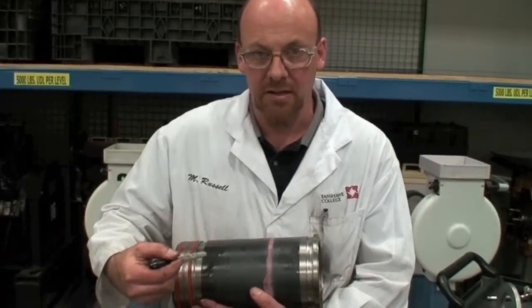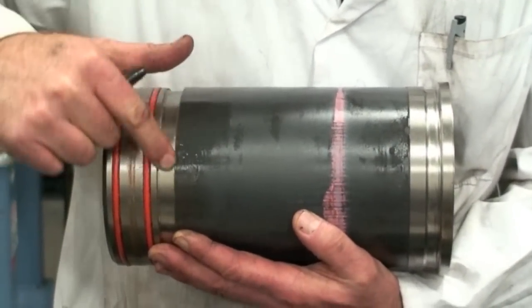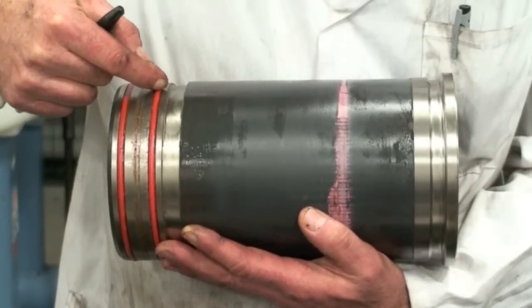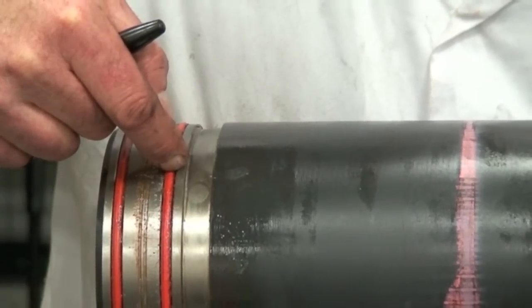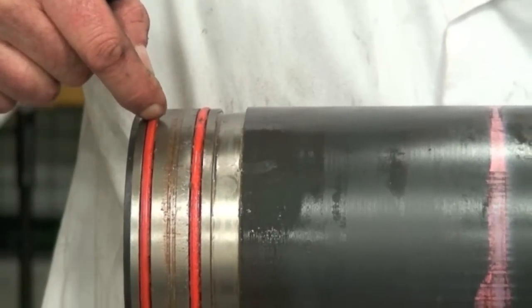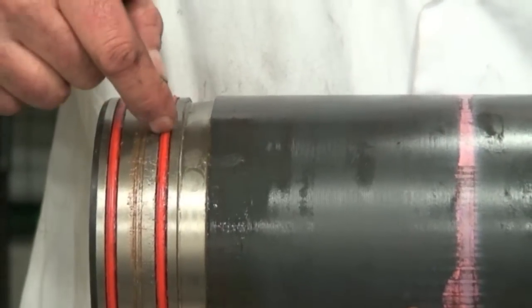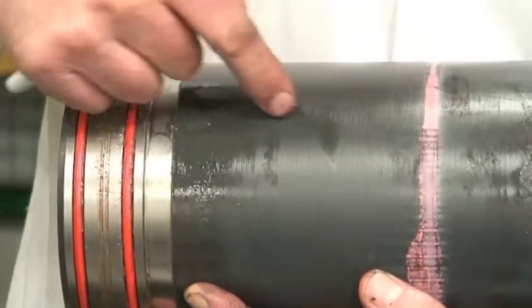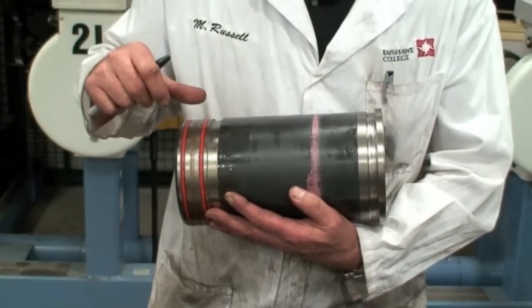If we take a look at the nomenclature related directly to the wet sleeve liner itself, you can see that we have a couple of different seals on here. One of these seals is going to be replaced. This is one of the main cooling system crevice seals, and then we have an adjacent seal that works in combination capacity with the cooling system seal — so if the cooling system seal leaks, the combination capacity seal helps back up the coolant crevice seal. On the bottom end we have an engine oil seal which also works in combination capacity with a secondary seal, so that if the oil seal leaks, the secondary seal helps prevent oil from getting from the bottom end up into the cooling system. When that happens we get the mixing of coolant and oil, and either or are destructive to the cooling system as well as to the lubrication system.